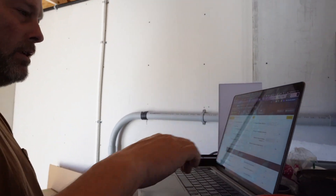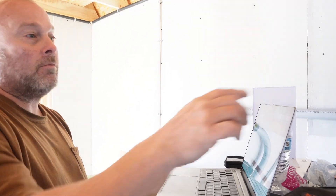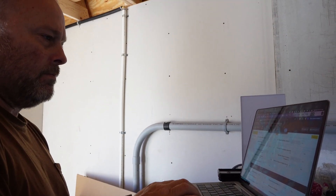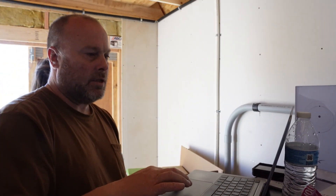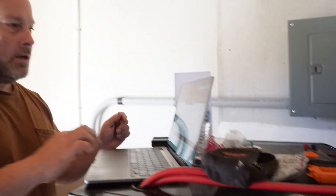I'm going to tell it instead of anything above 40%, let's say 50%. It's going to sense the batteries — it's all hooked up now — and it's going to say it needs to turn on the generator. My meter will say that it's connected. And this should be good. That means we're on — it's setting a signal to the generator to say it's time to turn on.